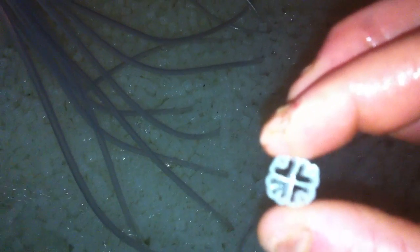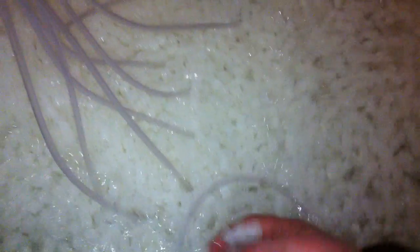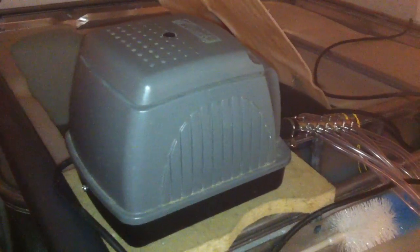This is 12-millimetre virgin material — it's not recycled, I got 100% new material. At the moment it's still getting cycled. The ammonias and nitrates are nearly on zero. I only have tilapia in the tanks at the moment, very few, and I have so much water that it doesn't really affect them. There's 400 litres of bio media in here, which works out to about three and a half to four thousand square metres of surface area. It's enough to hold about 80 kilograms per cubic metre of fish in each tank. This here is a 60-litre-a-minute air pump that simply pumps air down through these hoses. I want to do a few modifications but at the moment it's doing its job. This keeps the bio media circulating and self-cleaning, taking out all the dead bacteria which then land on the bottom of this tank.